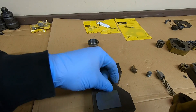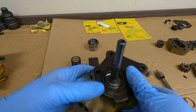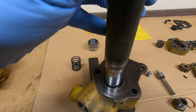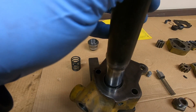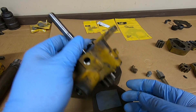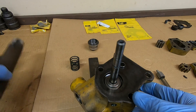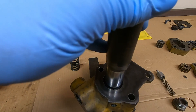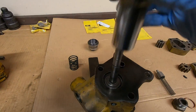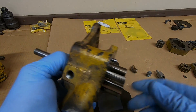Tamp that one in. Get that heavy block, and I'll put down a little scrap piece of gasket material to support the gear with so we don't do any damage to that. Just use our same special tool here. Stop periodically and do a check - we could go a little bit tighter with it, not detecting too much drag on that yet. Okay, I'm starting to like that - you can just feel some drag on that pump shaft.